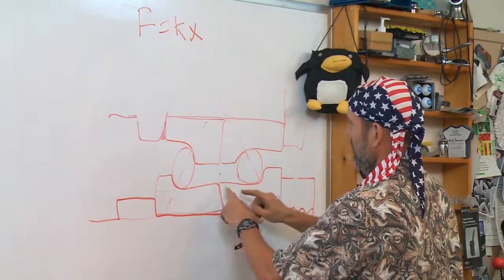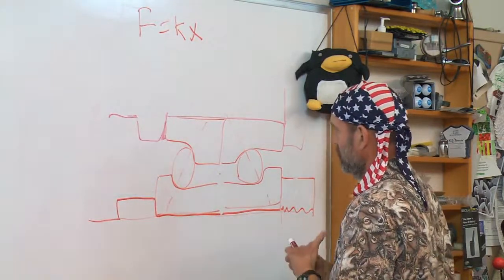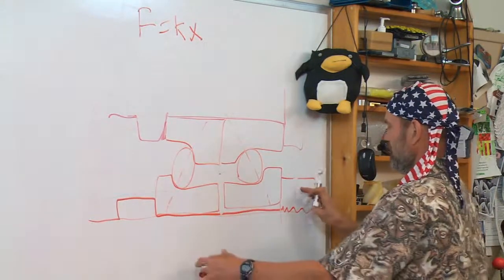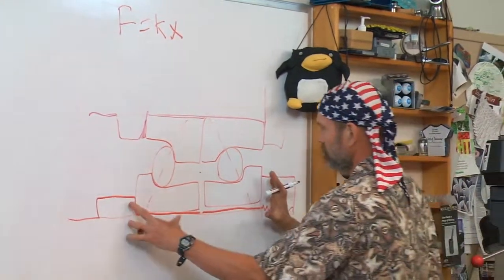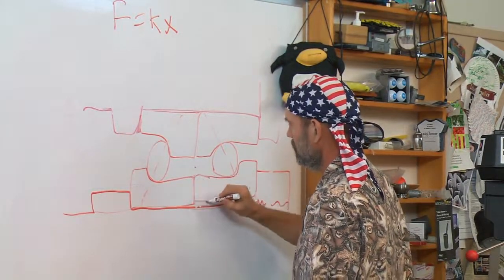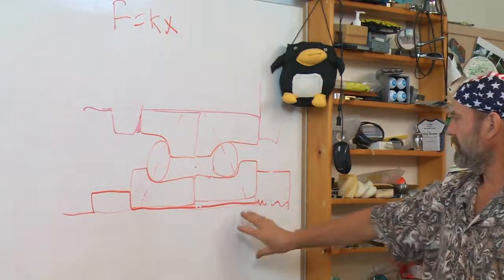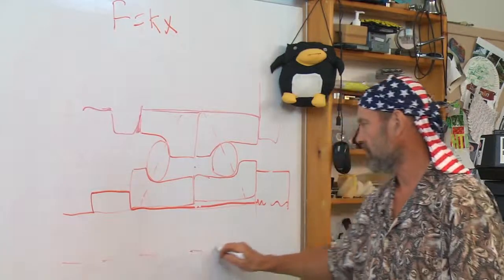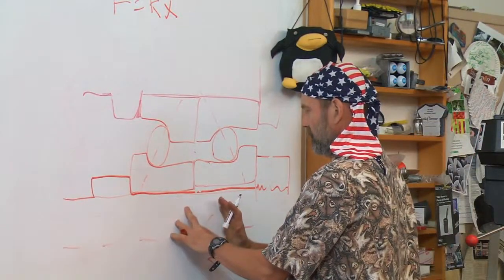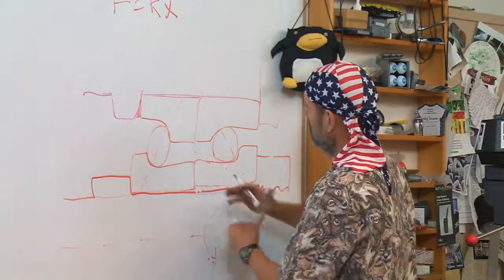The bearings have been made initially such that when they were manufactured and ground, these are made in pairs. There's a little gap here. And as this nut is tightened, that gap closes. That gives me the preload by the balls deforming in the raceways. As this shaft spins, this gets hotter and wants to expand this way, gets hotter and wants to expand that way.